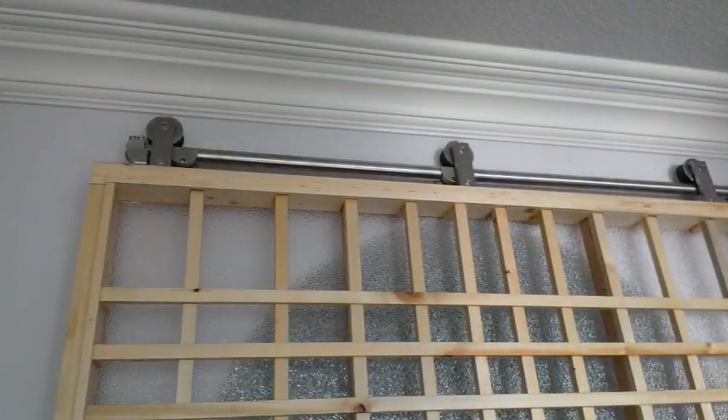And finally here are a few more JPEGs to show you some of the detail where the rollers are situated on the door and the track hardware. The instruction sheet shows that the standoffs or hold-ups for the bar are supposed to be at regular intervals — there are actually supposed to be six. I could only use five because the studs on this particular wall don't match 16-on-center, likely because of the arched doorway and another arch and inset on the other side, which throws everything off. So the hold-ups aren't evenly balanced, but nobody has mentioned it so far.